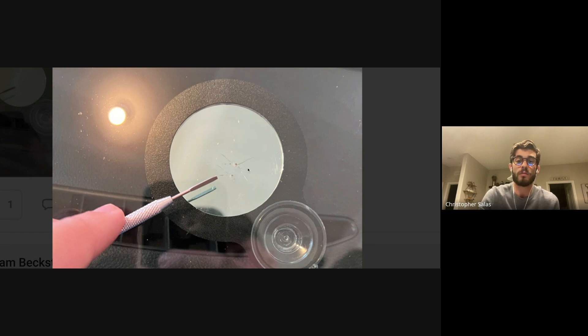That's only if you know for a fact that the resin has made its way throughout the cracks. The cycles are important because you want to go through them to make sure you're getting all the air completely out, and then when you're injecting, the resin is all the way throughout the crack. My assumption is that these cracks aren't completely filled — the resin isn't all the way throughout the crack. Some might be halfway and some might be all the way, but it's not a completely filled crack.